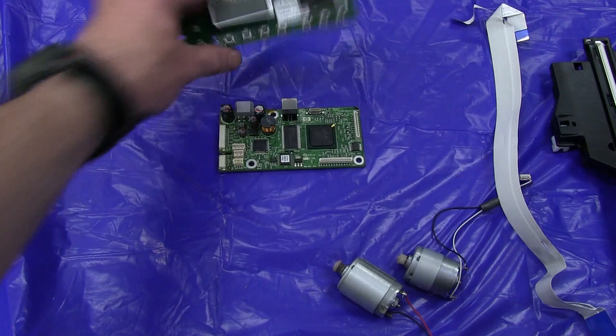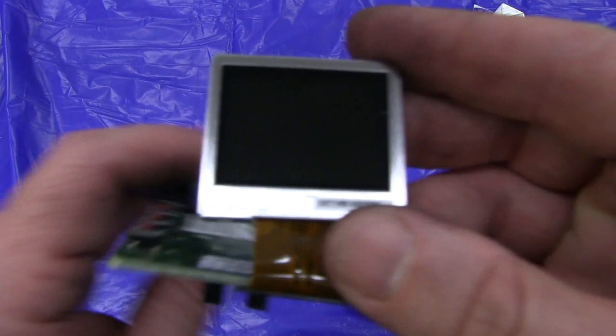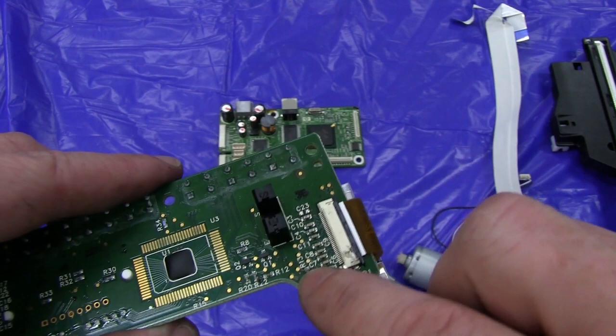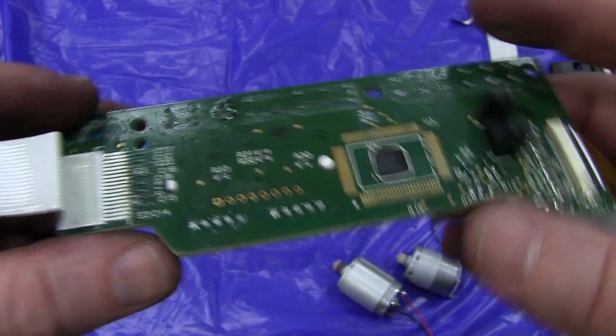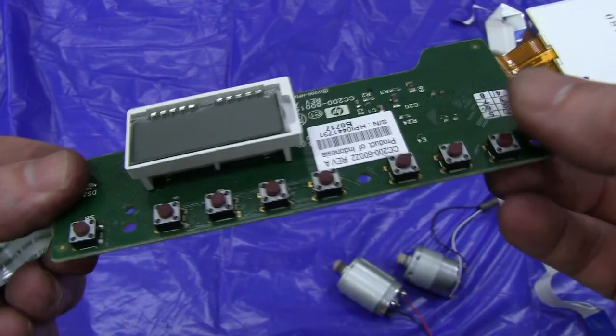Here's our module — there is our lovely, I believe it's a little color LCD module. I did actually power this thing up a couple of months back when I got it, and I believe that was a little color LCD module. Well worth scrapping that. And of course you could probably cut the board off or cut it across there if you wanted to actually get access to the connector — often there's no point getting these little modules if you don't get the flat flex connector to go with it. So you'd salvage that no doubt. Another photo sensor there — chip on board, the rest of it is the LCD. I can't remember what the LCD gave out, but very simple interface — you could possibly reuse that. The rest of it — would you bother getting the tactile buttons? I doubt it. Anyway, nice little LCD module score.